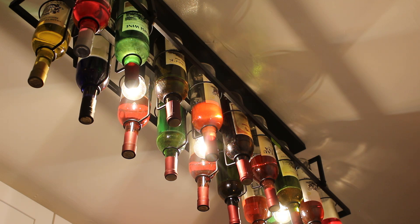The power is going to come from the breaker panel. I would recommend having a multimeter to check or double-check voltage, but most homeowners don't carry this, so here's an easy alternative. What we're going to do is turn the light switch on and make sure that we have lights. Then we're going to take a walk over to our breaker panel and flip the switch that we believe is feeding the kitchen — it might be labeled, it might not — and if it kills the power, that's the one.